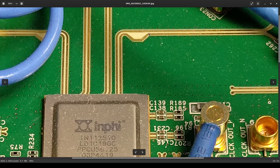Right here where there's a little jog in the trace to match skew for the differential pair, you'll notice it actually gets a little bit wider than in the closely coupled areas. That's because this section is not as strongly coupled to its partner, so due to the lower coupling the impedance goes up, and the trace width is increased to compensate. Somebody spent a fair bit of time in EM solver software optimizing that little transition.